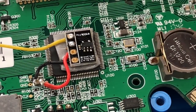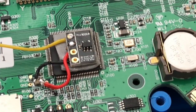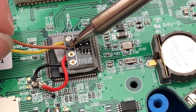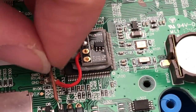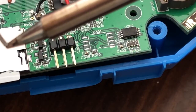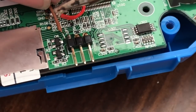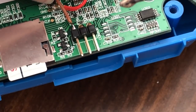Alright. Clean the solder off the tip. Get back to her. Trim this one up. Alright. Try this again. Version 2. Alright. Heads down. Now we can bring this one in. We'll put it straight onto the S port. So from here, I'll just hold it down ever so lightly and just touch it with the solder. And it's stuck now, just like it's supposed to. All right.